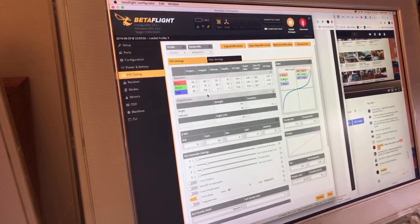So with the Acrobrat, it's pretty similar, right? It's got the cameras up front, battery in the middle going front to back, let's say. So I don't really need to screw around and turn the pitch down in relation to the roll, or give the pitch more, or anything weird like that. So I'm just going to leave the ratio of roll to pitch alone, but I'm going to bump these D-mins up a little bit because I want to handle it.